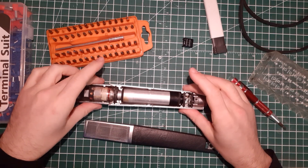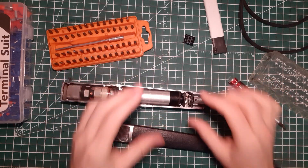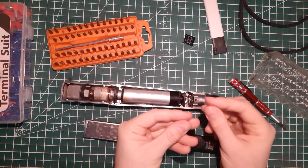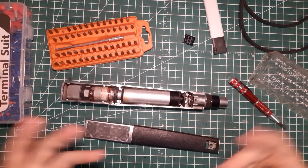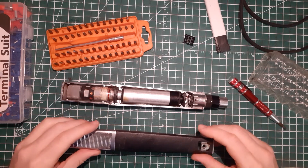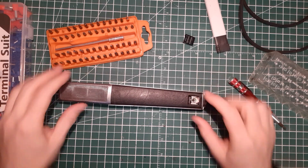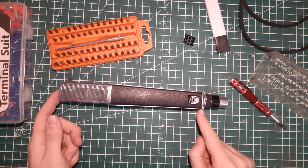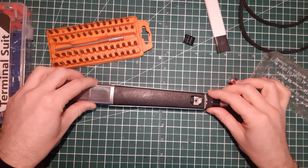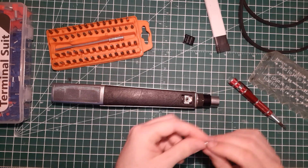This is not a fully functional microphone, which is a bit of a hassle. But now that you know how to open it — it was really easy. You just need to be careful with these tiny wires, and the soldering is not always perfect after a few years of use. To close it: place it a bit offset, maybe half a centimeter each side, then slide it down. Then rotate the barrel a little to align the screw hole.